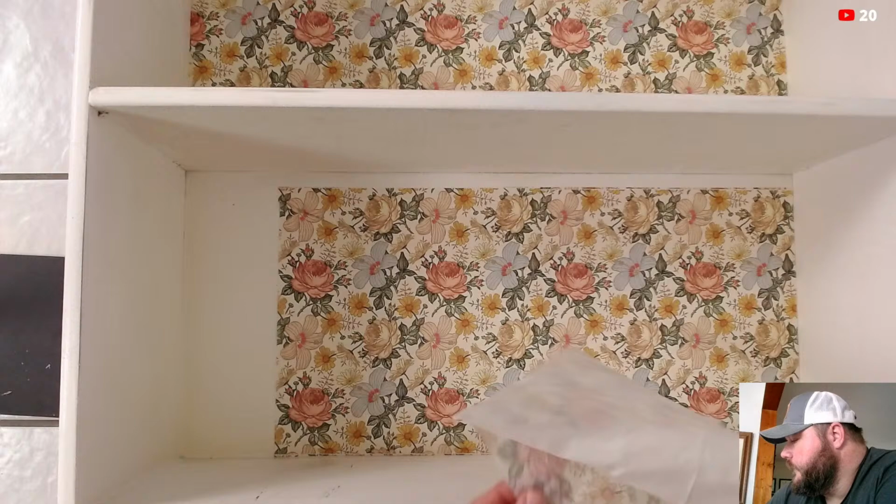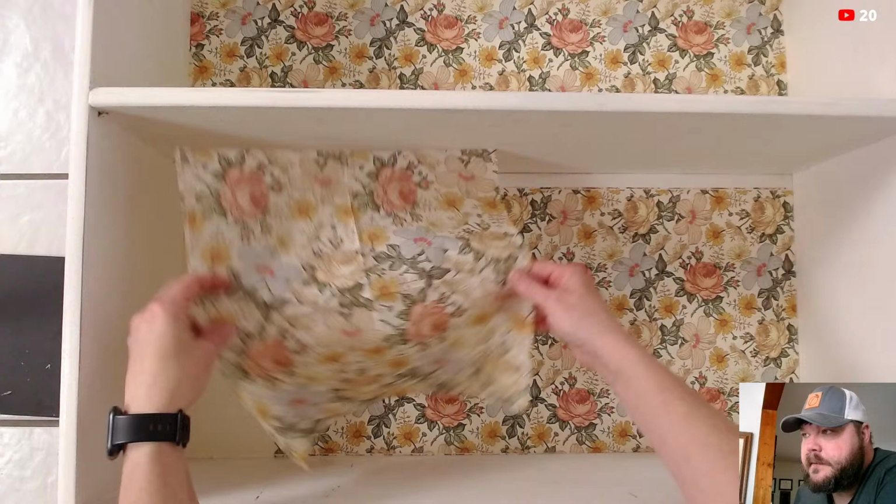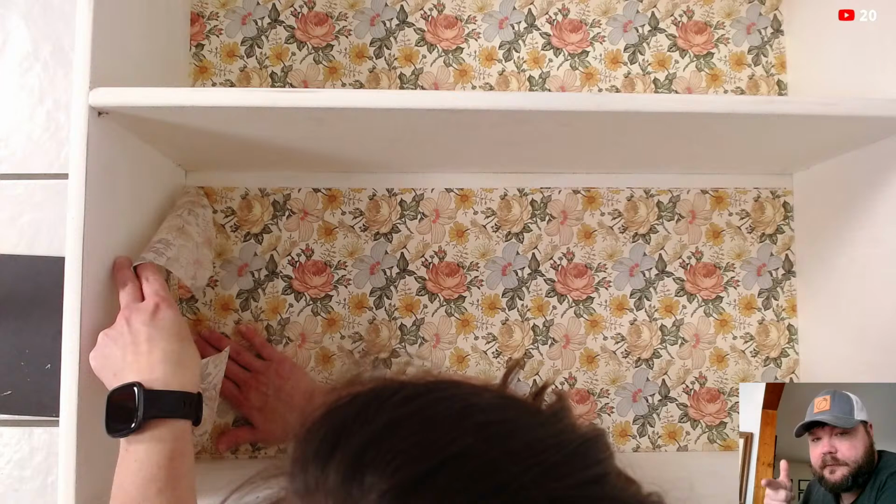Then there was this big 2x6 that was embedded, or not 2x6, 2x10? I think so. 2x10 embedded in the stucco. And when we pulled it out, I had to grind off the nails that were holding it into the wall because they used that powder actuating nail gun, so it fires a .22 shell basically and it pushes nails in the wood. So we had to grind those out.